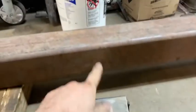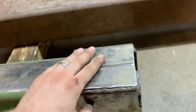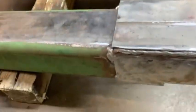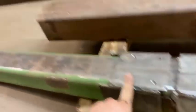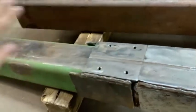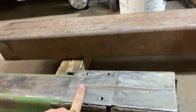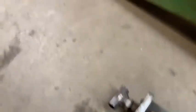This is a five-inch tube and this is a four-inch tube — this slides inside. The reason I chose that one-inch difference was so I could do the plates like this, because you've got to have a way to keep it from sliding out. This fits on here — these are the four bolts that go in there — and that butts right up against that, which is the stop that keeps it from coming all the way out. So you can kind of see how this fits together: put this in that tube, slide this in, put your four bolts in, slide the cylinder in the back, put the four bolts in the bottom, and then put the half-inch bolt through the end hole — and that's how it all fits together.